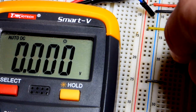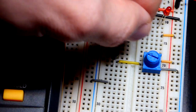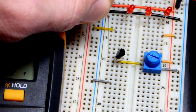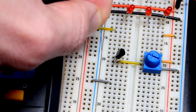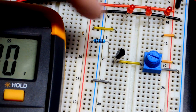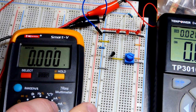I plug in the transistor, placing the middle pin — the base — where the jumper comes from the trim pot. This is a 1 kilohm resistor, which makes the math easy: for every volt across it we get 1 milliamp of current. The emitter connects to the positive rail. Because the resistor is on the emitter side, it works with the voltage at the base, but we still account for that 0.7 volt diode drop.